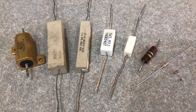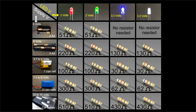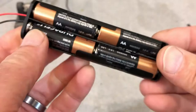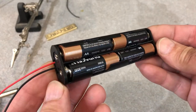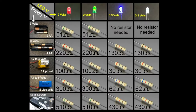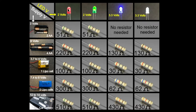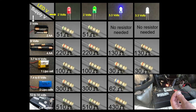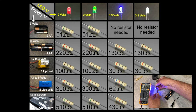Resistors come in a huge variety of sizes and values. To help with that, I put together a cheat sheet for common low power LEDs, batteries, and resistors. Pause the video and take a screenshot and print it out if you want. To use the cheat sheet, know your supply voltage — I'm going to use my four AA holder that puts out six volts. Then know what type of LED is going to be used and select the resistor. Here's the red LED with a 220 ohm resistor. Red LED to 12 volts with a 510 ohm resistor on my old truck battery. And a super bright blue LED to four double A's with a 130 ohm resistor.